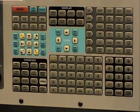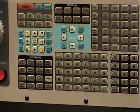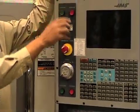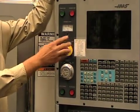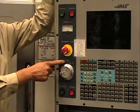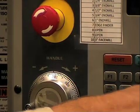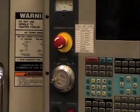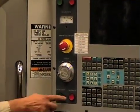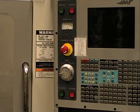A lot of these keys are beyond what we do in this class and what we need students to do with the manual. Over here: power on, power off, and emergency stop — this should be highlighted prominently in the manual as a major safety issue. This knob controls the rate of jogging and is called the handle — that's why the button says 'hand jog,' it's really handle jog. Also: cycle start, and feed hold — that's what it's labeled, feed hold.